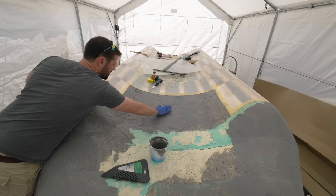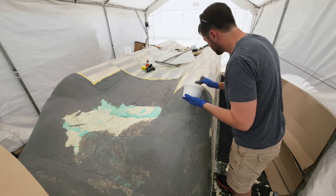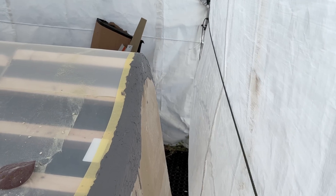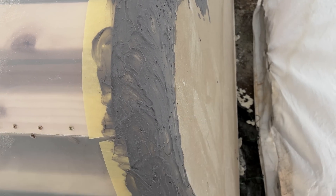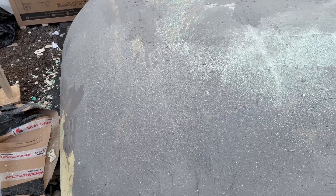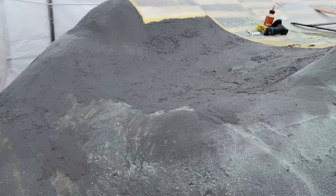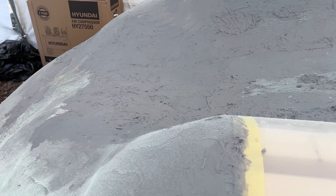Proper purpose-mix fillers will contain a wider range of fillers than I've done here — this is pretty resin-rich. As a base surface covering and not the final fairing, this is fine. It'll be slow to sand but will have a lot more strength and integrity than bodywork filler. I like this as it'll support the foam below which would otherwise be susceptible to damage. Not forgetting the other end of Bernard — nice job if I say so myself, which I can, as it's my channel and I write the script.